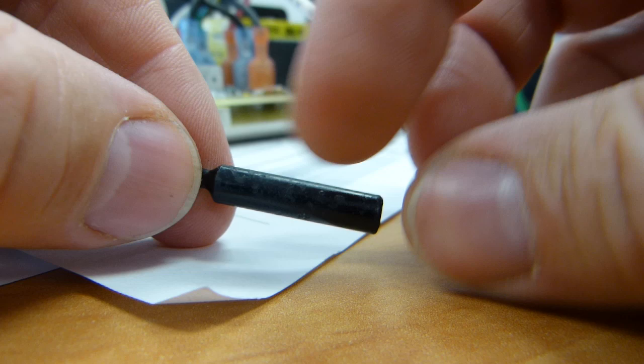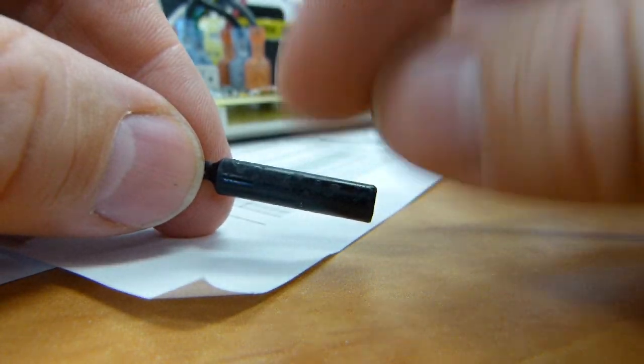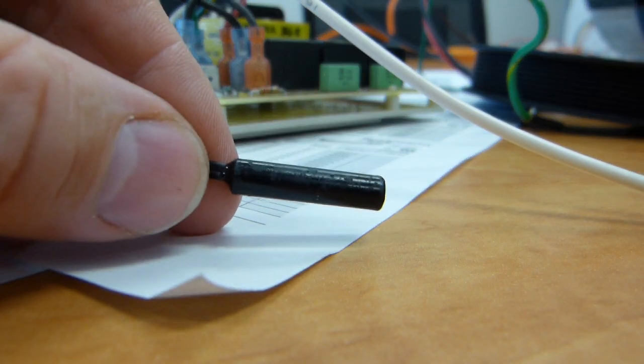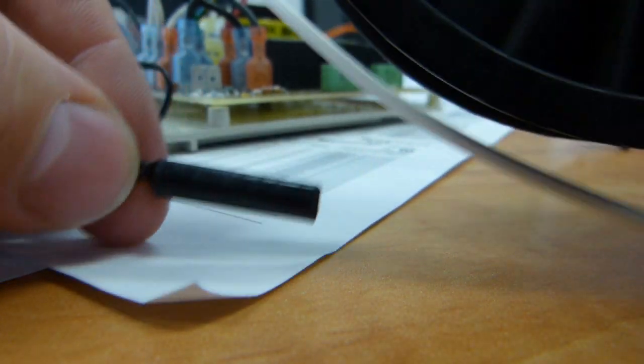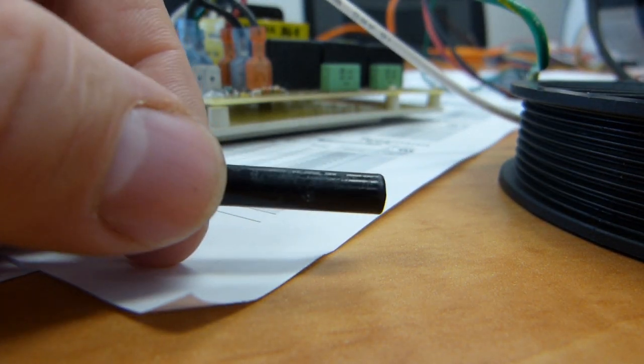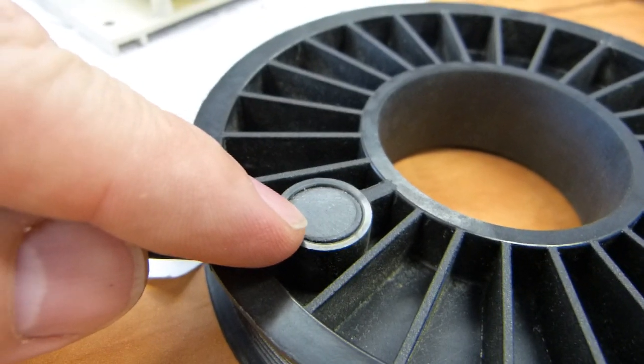Let's get back, for one sentence, to the fact that this is solid state. So how does this work? And how did this get damaged? Of course, it's close to these rotating items such as this flywheel. And how this works is, inside the flywheel there's a piece of magnet, which you can see here.